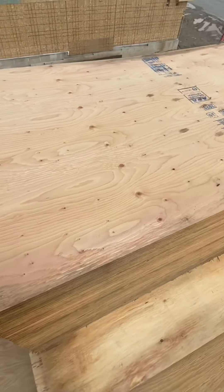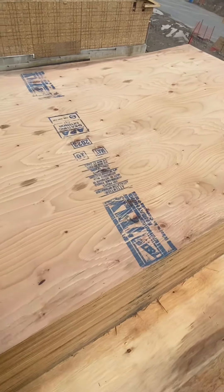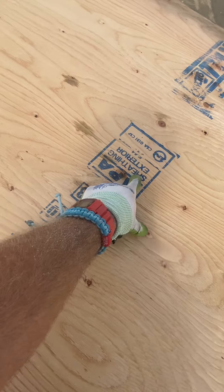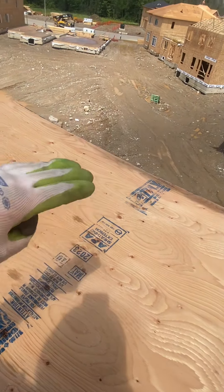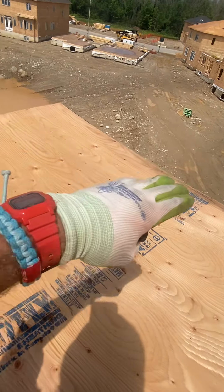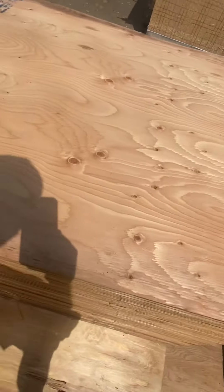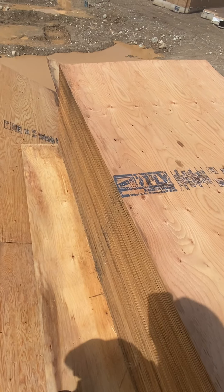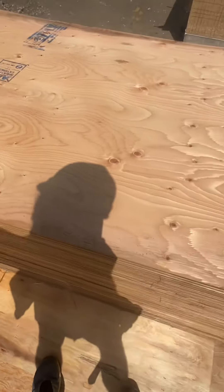Another thing — I just boomed up these sheets. It's important to just throw a spike in somewhere in the center, just tack it in three quarters in. That's basically so that when you're lifting, the wind doesn't catch it or the sheets don't go forward. I haven't touched these sheets and they're nice and perfectly straight in line. Didn't have to hand bomb them off, thankfully.